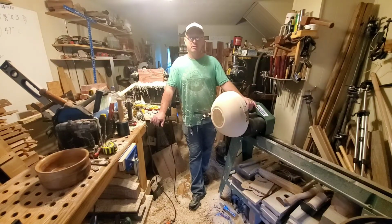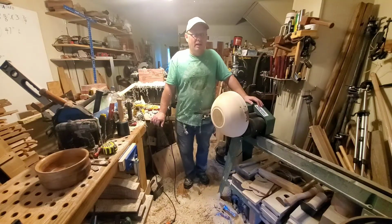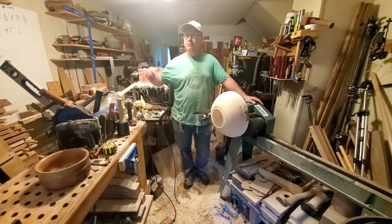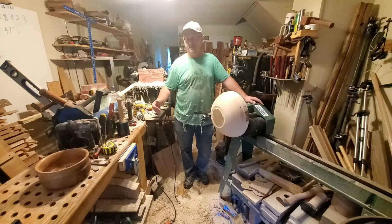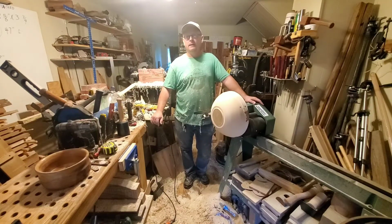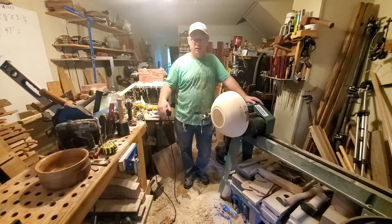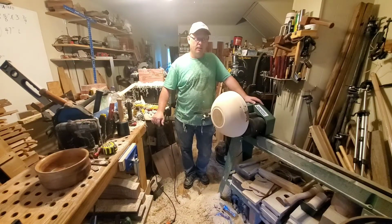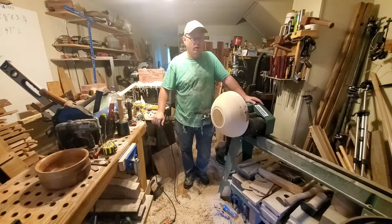And if I get a place with a well or something, I probably would get a place without a well at first, but I could haul water, and I could get a storage tank or something. With my sawmill, I could build me a little water tower, haul water to my location, and pump the water up into the tank. I could probably even have rain catchment and water filtration and all that, and just run a 12-volt on-demand pump. You just flip a switch, pump it up into the tank, and then use the head pressure from that tank for your water.